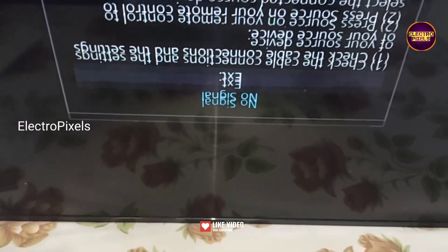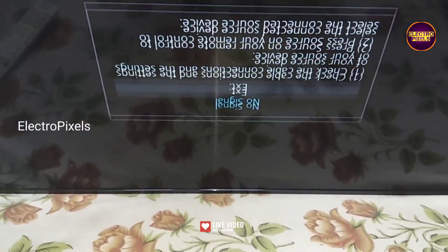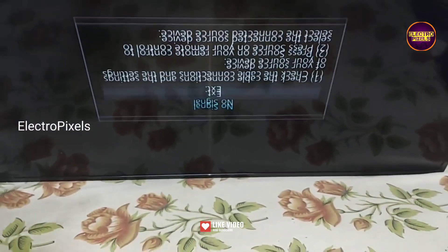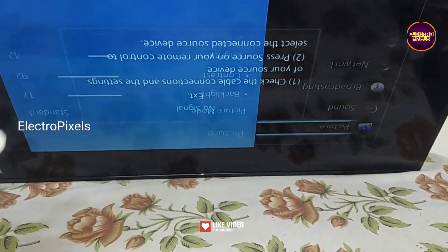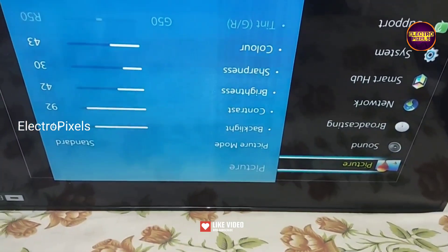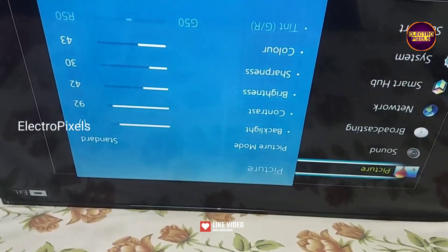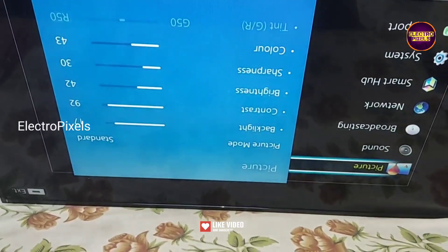Welcome friends. This is a 32 inch Samsung Smart LED TV. In this TV the complaint is picture freezing issues. Here you can see this fault — as we discussed earlier, these types of complaints are mainly due to internal shorting in gate signals inside the glass panel.